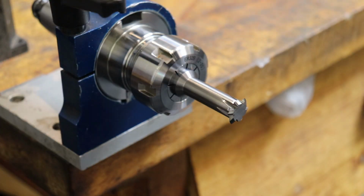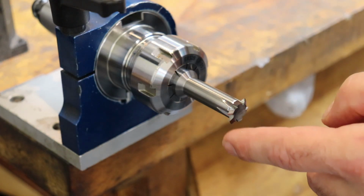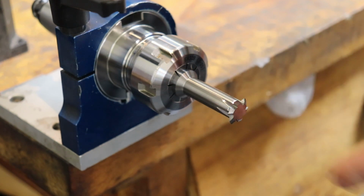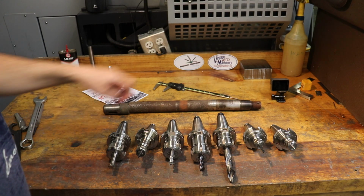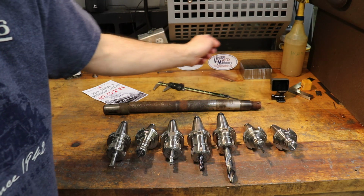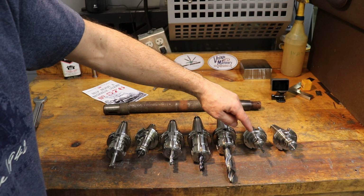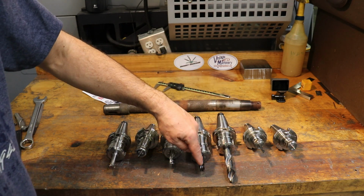This is a close-up view of the single point thread cutter. Basically there's a single plane of teeth that helix around and cut the threads, internal threads, into our castle nut here. All right, so here's our collection of tools. This is the center drill, which will set all the spots for the drills. This is a quarter inch drill, which is going to be the pilot hole for both the 3/4 inch drill, as well as the two